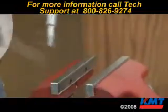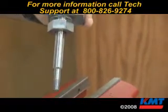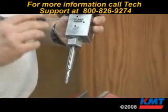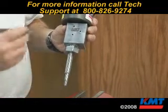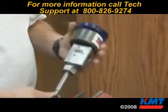Water leakage out the nozzle tube when the valve is in the off position and you have high pressure water coming in means the needle and seat inside here are not mating up, and we got something damaged with them, so we'd have to replace it as a kit.